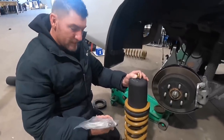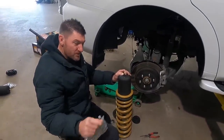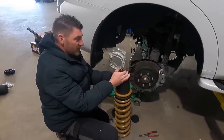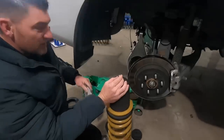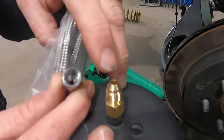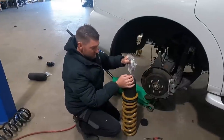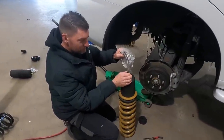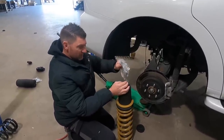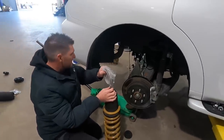An easier way to describe it - you know how we have common rail with such high pressures, and all the common rail lines that go to the injectors? They have the same setup where you bolt it on top and it beds itself into the little cone section. That section is done up so tight it makes its own seat on that top section. For us to achieve this is just amazing - it's never going to leak. Once you've done it up tight, you don't have to put any sealant on there, nothing - you just put it on, lock it down with two spanners, and it makes its own seat. Perfect.